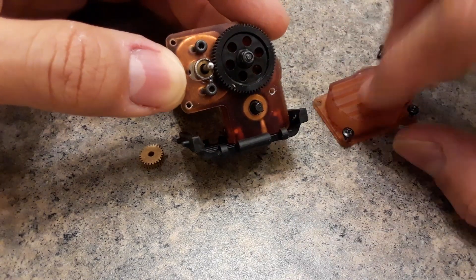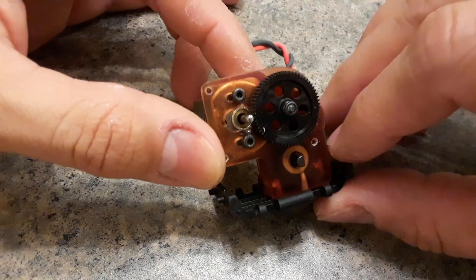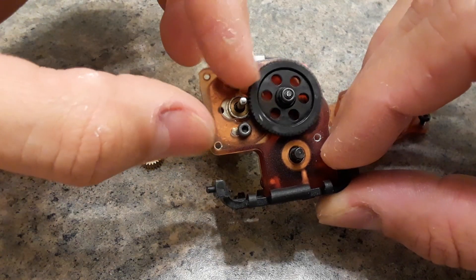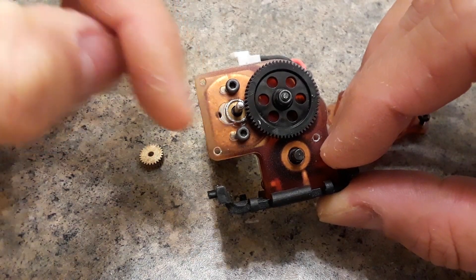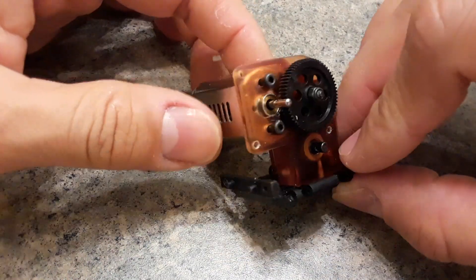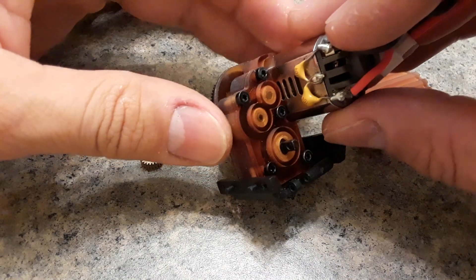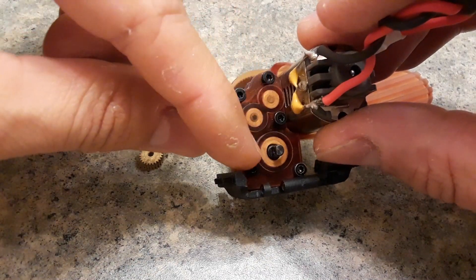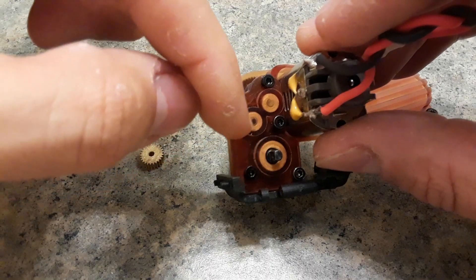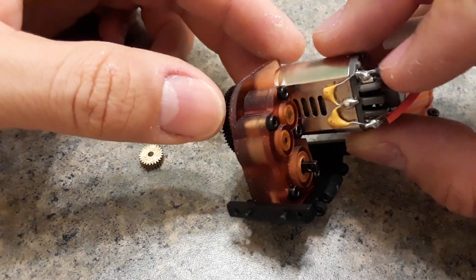The difference between the drive shaft and this piece here is like a millimeter — it's extremely small, just enough to get this to fit in there. The motor itself only goes up to this side. Some people commented that if I twist it this way it will work, but it really wouldn't because the motor can would be tilted and that end right there would be sticking out. The best way to put it so it fits perfectly is just straight like this. That is the lowest you can go when using stock gears. I wanted to bring it lower so this gear would mesh directly with this one, but there's not enough room — we needed the middle gear to make that connection.